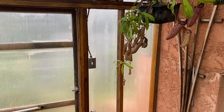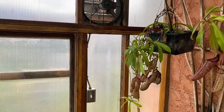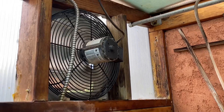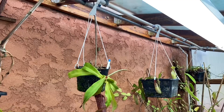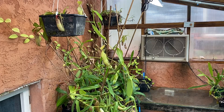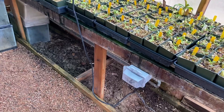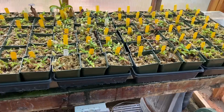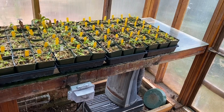For electrical, this is on its own breaker — just one breaker, which is enough, although it can only run one space heater at 1,500 watts. Everything else runs fine. The exhaust fan is up in the high corner. I have some shop lights in here that help if I want to work at night, especially in winter. There are a couple of outlets in completely enclosed outdoor-style fixtures, all on GFCI-protected outlets, so just in case something trips it won't give me too much grief.